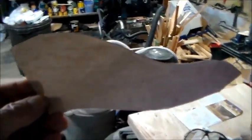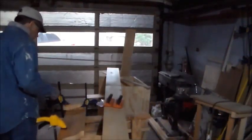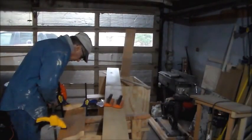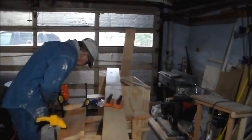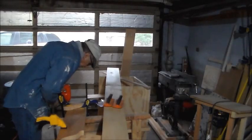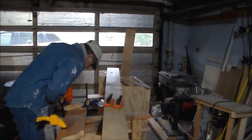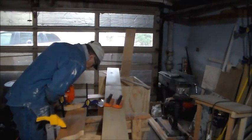This is the pattern I used to create the legs for the stand. I proceed to cut those legs after tracing the pattern onto the wood. I'm using a jigsaw here — it's a little more difficult than utilizing a bandsaw, but I don't have a bandsaw. I just cut slowly outside the lines, cutting around that pattern until I complete the cut, and I'll do that with all four legs.